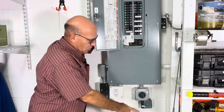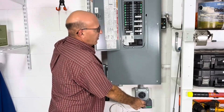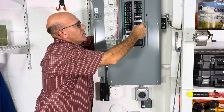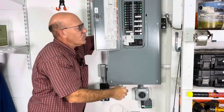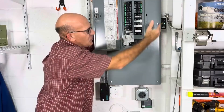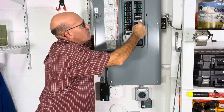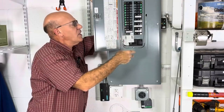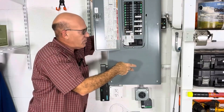With the Square D device, we've run the wires up to the air handler — two hot wires into the breaker's hot wires, the neutral to the neutral bus bar, and the ground to ground. The same thing with the Daikin: it goes over to the air condenser, the two hots go into the breaker, the neutral down to the neutral bus bar, and the ground to the ground.